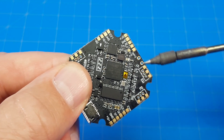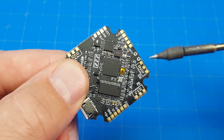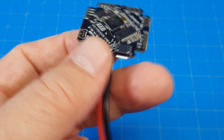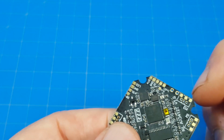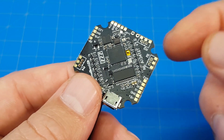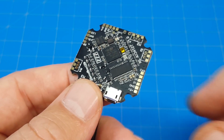These are our two pads for the capacitor right up here. This is for your plus side, this is your minus side. If you're not familiar with capacitors, the side that has the stripe down it, that's the negative side, so you want to put that side over here. It's nice because if you've got a frame or canopy designed to go right down on top of it, the props would just probably rotate right over the top of it. Of course, you might want to wrap heat shrink around that — that's something we should all be doing.